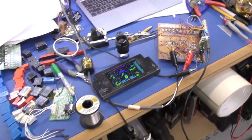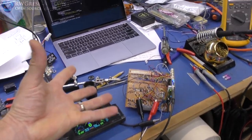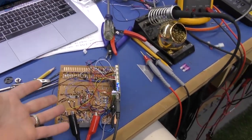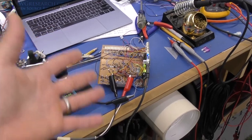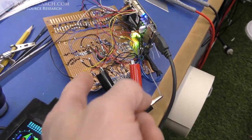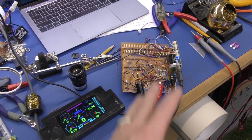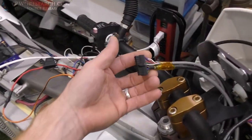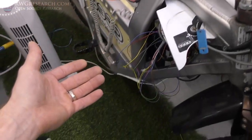It's the day after the Fourth of July - we're all tired. I have managed to finish the software to at least turn on the extra relays that I need to turn on the power to do everything else. I've got it hooked up here - there are relays on the bottom I'll show you later. I've got it hooked up to the power supply and tested all the low voltage: 12 volt, 5V, 3.3V, etc. Looks like we're good to go - now it's time to plug it into the bike and hope I wired everything else correctly.